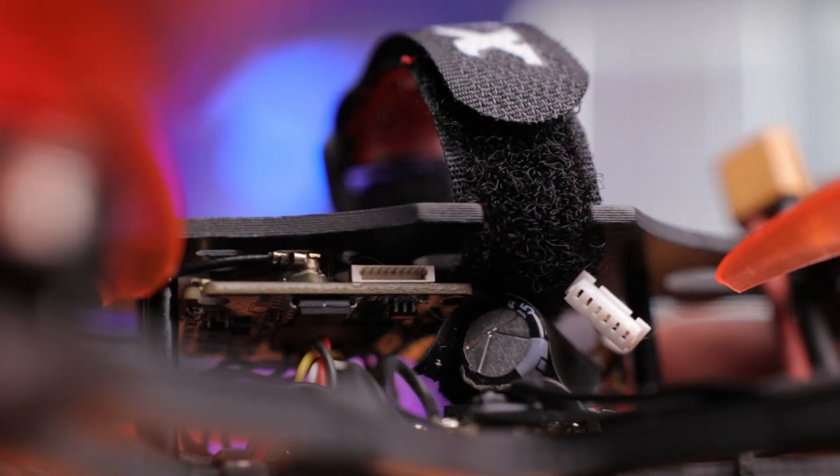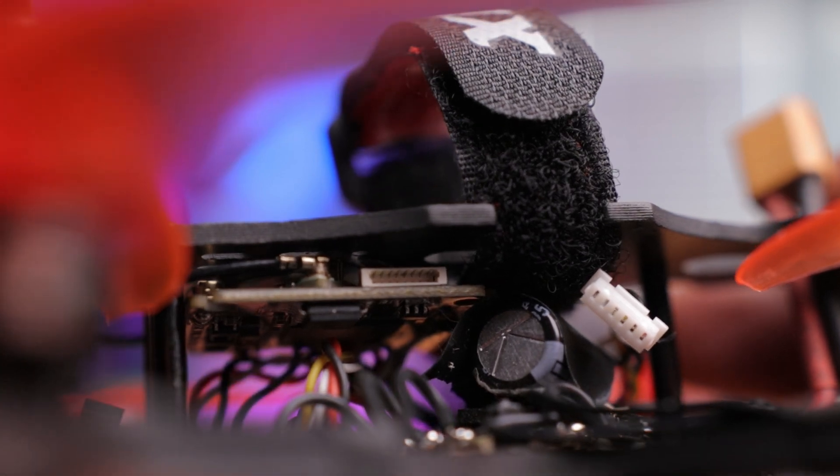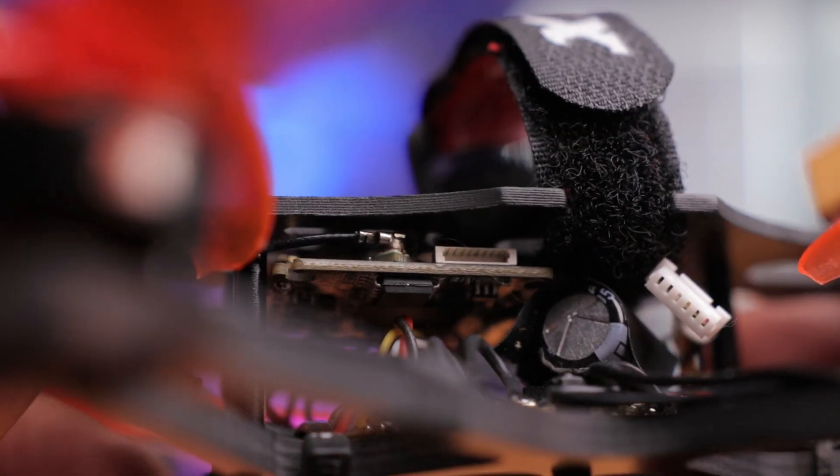Not too bad. That's not the lightest thing, but this was designed to fit into larger drones — think three and a half to around seven-inch drones. This one has a lot more performance compared to the gen one product. Emax has done some improvements with the chipset. If you think this VTX is too big and heavy for smaller drones — anything under three and a half inch — Emax still has you covered with their 100 milliwatt VTX. I have it installed here in a Baby Hawk 2. It's a single board, super light, and you could probably put it into even a 65mm drone. I've done a full review on that VTX — I'll leave a link above and below.